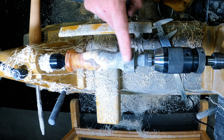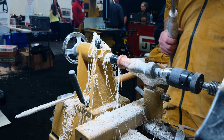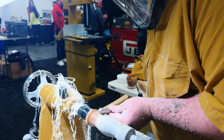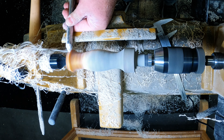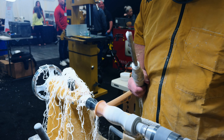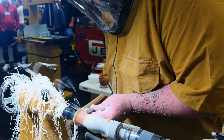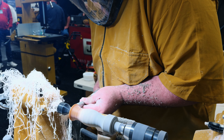I'm going to put a little decorative flare down there and another decorative flare on the other end. For that I'm going to use a bowl gouge — got a nice 40-degree grind on it. All we're going to do is just roll that bead over. Don't push it — let the cutter do all the work for you. Going to bring our RPMs up a little bit, now we're going to be a little over 2000 RPMs. When turning resin, that's exactly what you want — you want to see that really nice ribbon come flying right off it.